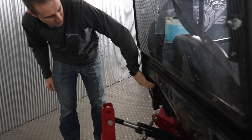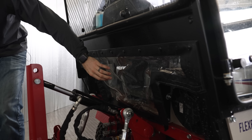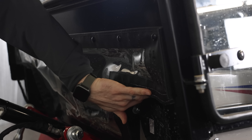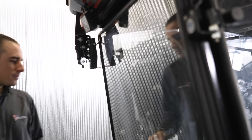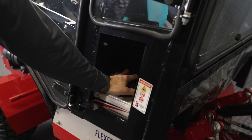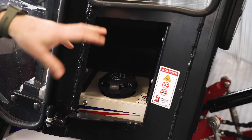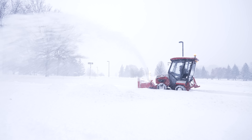There are a lot of little panels here too to help contour the tractor. A tractor is a really complex shape, but you've got panels that are molded to the shape of the tractor and velcroed in so that it has a really good seal overall, trapping as much warm air in as possible. The cab also goes on the outside of the ROPS, so you retain the ROPS for rollover protection. On the left side, access to the fuel tank is still exterior — there's a door built in so the fuel tank is isolated from the outside, keeping any fumes away from the operator.